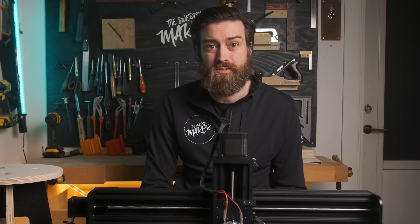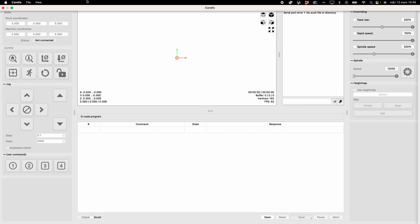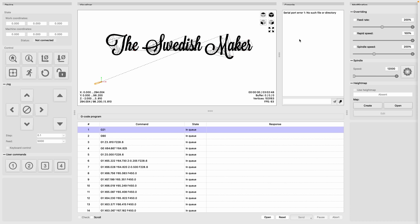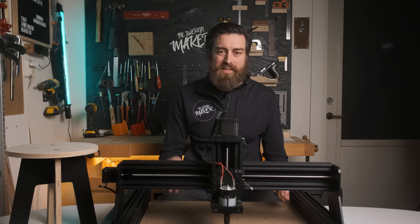What they mean is that you can export the G-code and use it with the software that they send with the machine. The USB stick provided comes with a software called Candle, which is — well, fine. No, actually, compared to Easel at least in my opinion, it isn't. But you can use Candle to send G-code straight to the machine. I placed my G-code onto the SD card instead and had it run directly from the machine display.